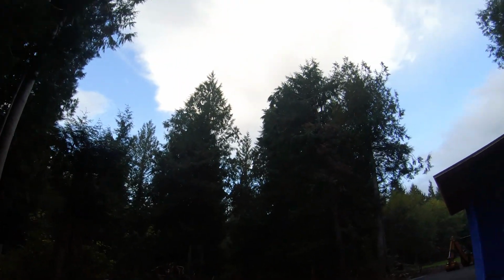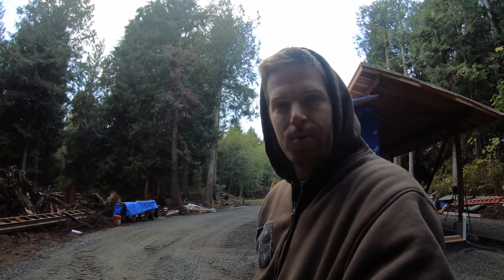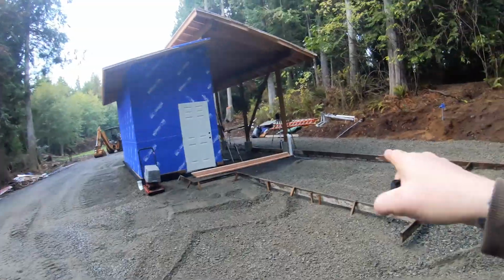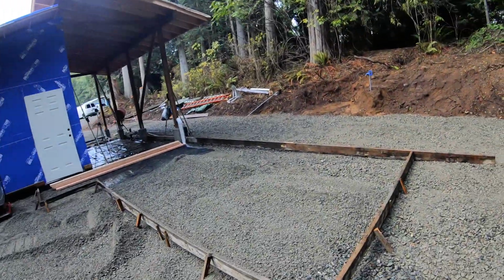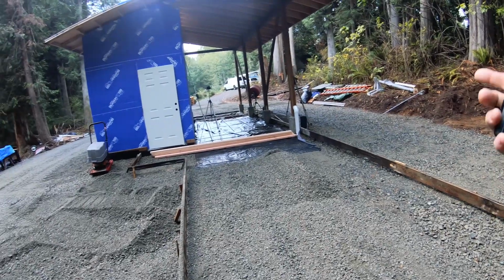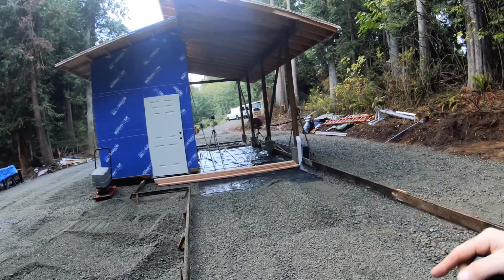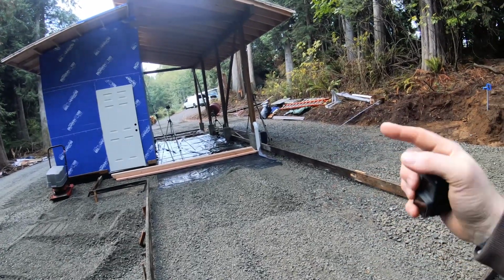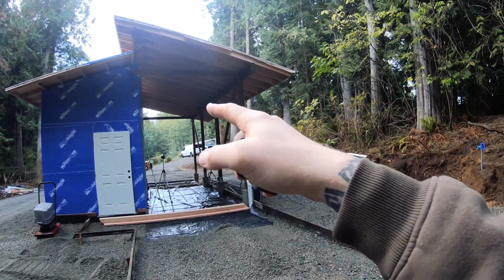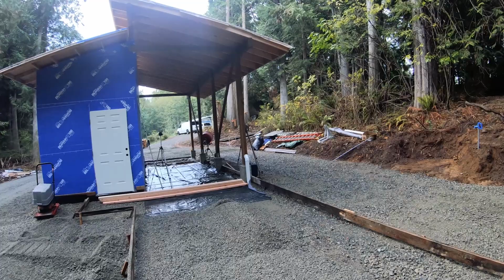Okay, so there's some blue sky up there. It's good because I ordered some concrete to come today. But as you can see, I'm still not ready. So I gotta fire up the backhoe, finish getting all this gravel laid out, drop the compactor in here, compact it, throw the rebar, and throw a few more braces in down there. And then I'll be ready.